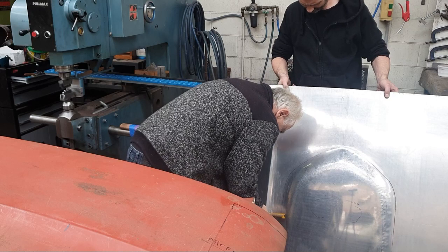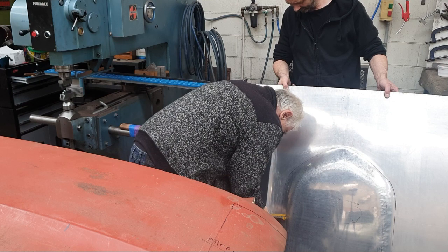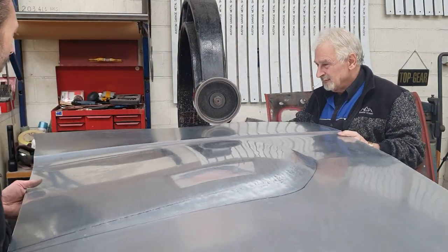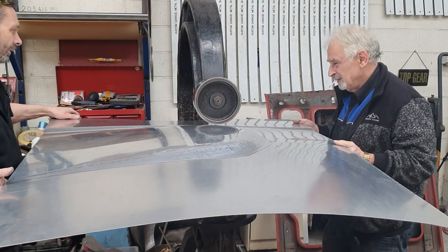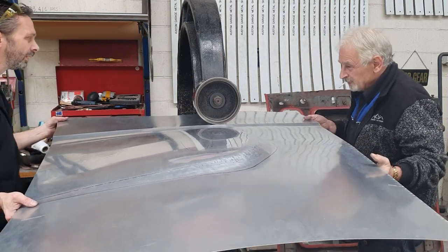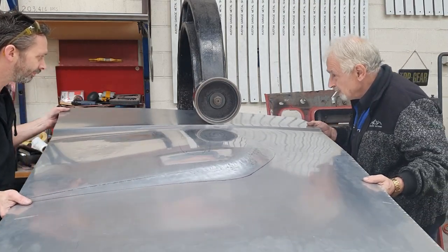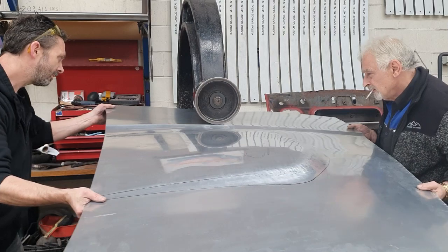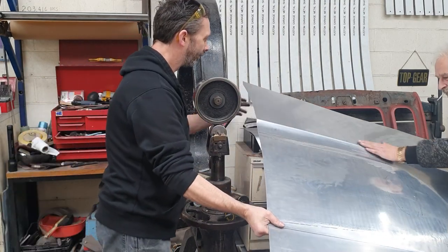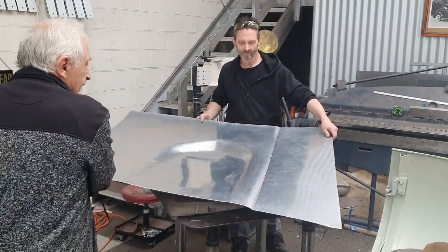We've just off camera put a little bit more fold in to even it up and get some more depth to that reverse, then transferred over to the English wheel. Peter's already put a sharp wheel in the lower anvil and tipped it up on the edge so we can work as close to that profile as possible without doing any damage. We're going very slowly, just trying to stretch that metal a little bit just where that line has been formed. You can feel as you move the aluminium through the wheel where it's tight or where it needs to be pushed up a little extra.